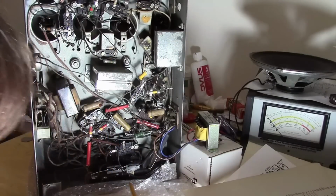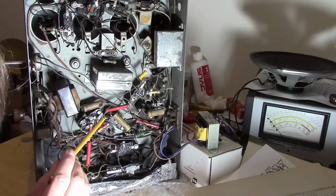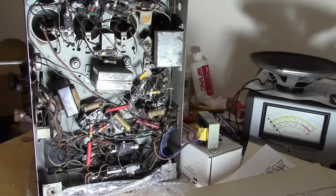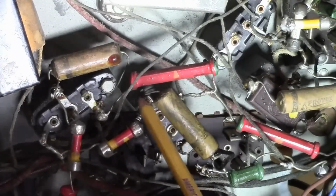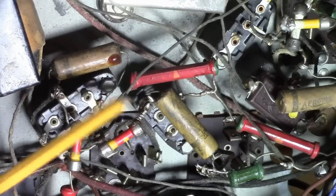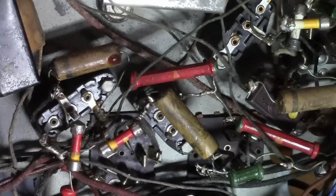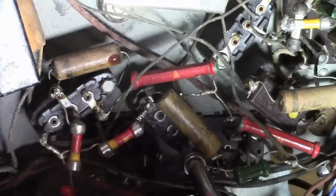And I bet it did, because look at this red resistor here and this lead on it. That's coming pretty darn close. I'll zoom in for you. Here, that doesn't look right to me. That component lead's getting awfully close to that. And they show this as being mounted vertically. Let's see if we can loosen that nut up a bit and rotate the whole thing around.